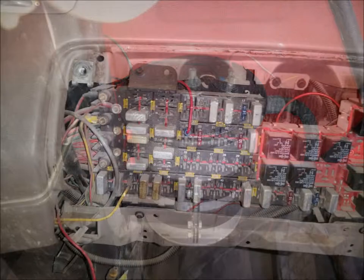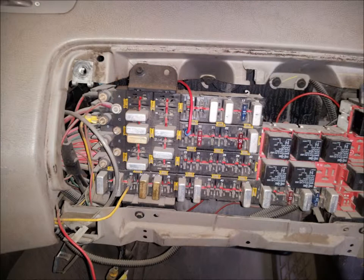Back at the power distribution panel in the cab, route the red power wire up and behind the power distribution panel as shown. Strip the end of the red power wire and crimp one end of the blue butt connectors provided onto the exposed wire. Connect the inline fuse to the other end of the blue butt connector just installed, cutting the wire loop on the inline fuse assembly and stripping the ends of the wires.